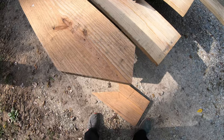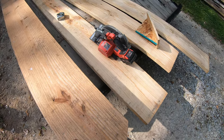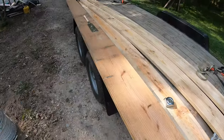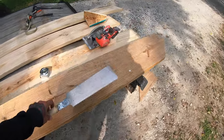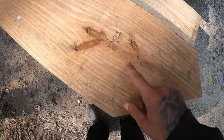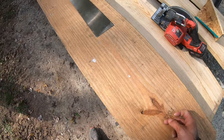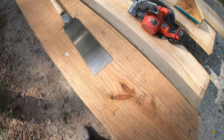All right, first cut — not so bad. That saw is not the easiest to work with. Obviously this part here is what's going to be sitting on the concrete. It's a good thing we have this Japanese saw — I can't remember the name, it begins with a G, I'll post a link in the description — because you're coming up to a corner with the circular saw. We'll run the saw up to the corner and then finish that 90-degree cut with the handsaw so we don't overcut.